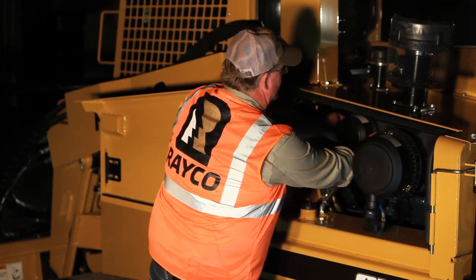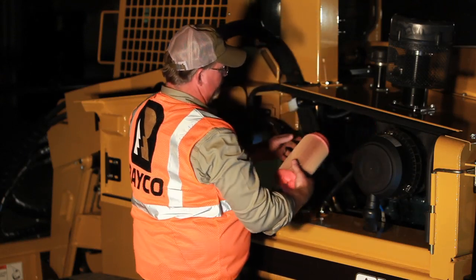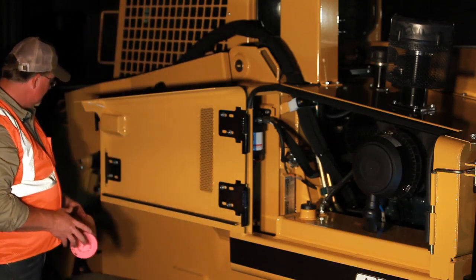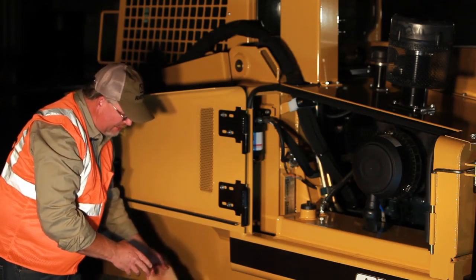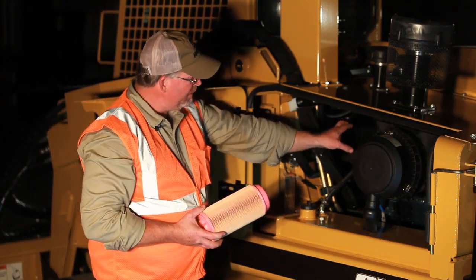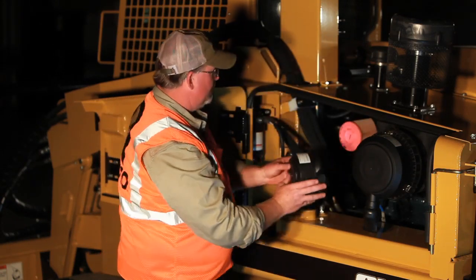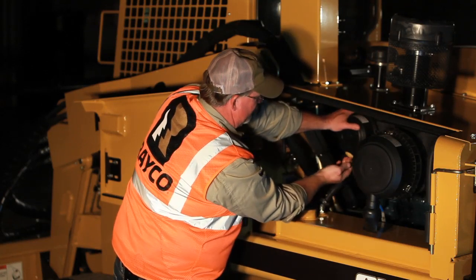Also on this side is the air filters. The small air filter is for you and the cab — it cleans the air going into the cab for the air conditioning or the heat. To clean these, you step away from the engine and smack it to clean it off, rotating it in your hand and knocking the dirt out. We do not recommend high compressed air on these filters. The pre-cleaner cleans the air going into it and does not have an inner air filter. Put it back on, rotate it, push it back in, take the cap back in place and pop it back on by smacking both sides of it, leaving the yellow drain at the bottom.